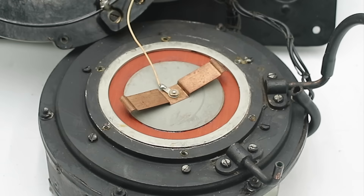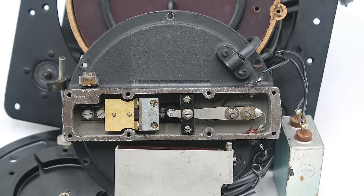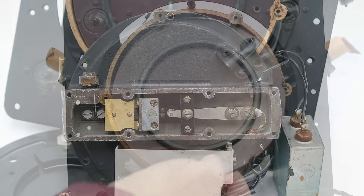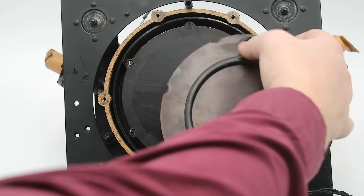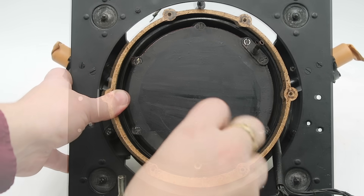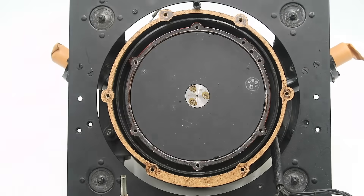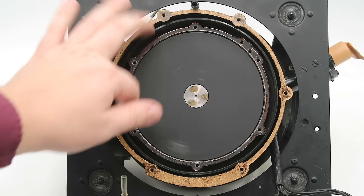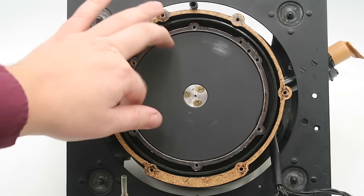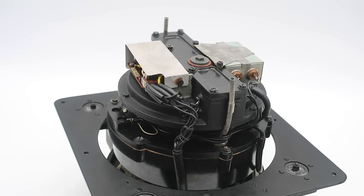What's important to note are these electrical contacts on both diaphragms, which are connected to the motor circuit and help regulate its speed. Turning to the top module and removing this phenolic plate, we find our fan. I can't disassemble this any further without damaging it, but this is a fairly standard centrifugal fan. Air enters at the center, gets pushed to the outside, and is tapped off by a scoop connected to this hose and conveyed to the lower compartment.